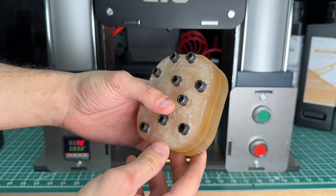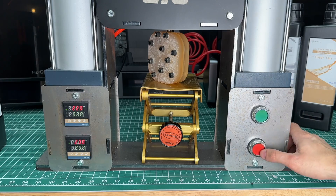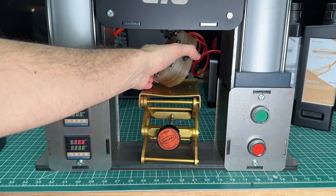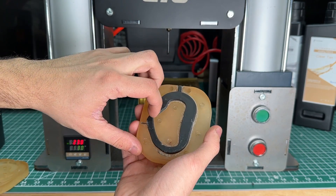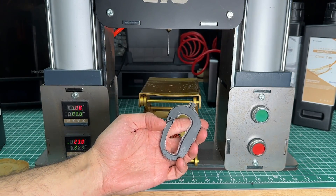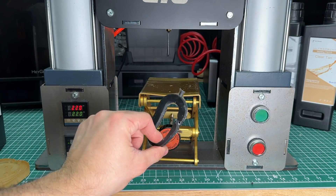Here's our second mold all clamped up. I'm hoping we can see the carabiner fill the cavity, so I'm facing the vent hole outward so we know exactly when the cavity is full and can stop the injection. There it is — we can see it getting filled, so I'll give it a second and then lift the injection arm. I pull the mold out and let it cool. A few minutes later the mold has cooled down, so let's crack it open. That looks awesome — it's not too difficult to pry out. A little bit of flashing, but not bad at all. I can trim that with the razor.